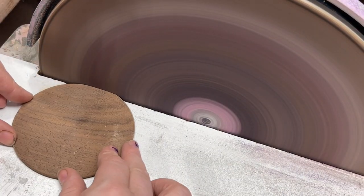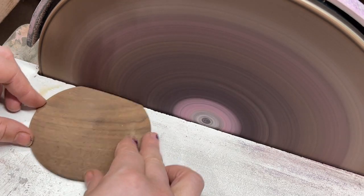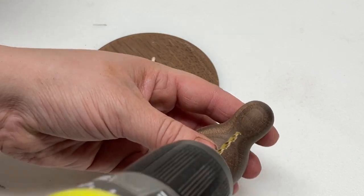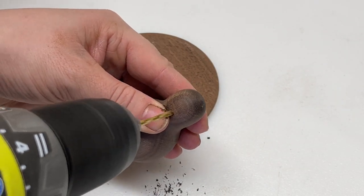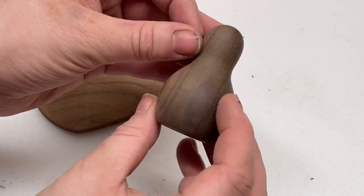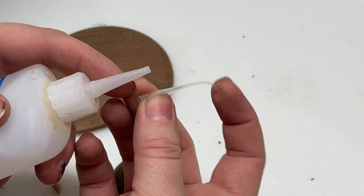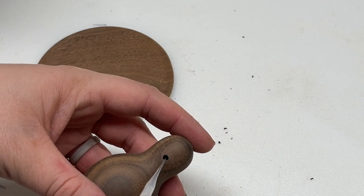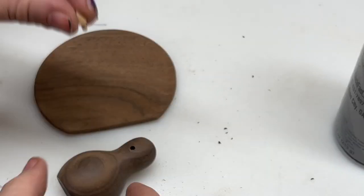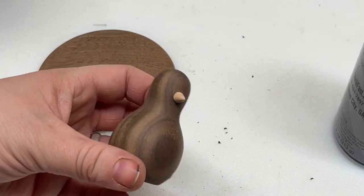I'm taking it to my disc sander, finding which side I like better for the front of the turkey, and then sanding a flat on the back. Because I don't want it to be a full circle — I want it to be kind of a semi-circle — I'm going to find whichever area I don't like and sand that edge off. Now I'm ready to drill the hole for the beak. I like to drill slightly larger than the tenon I've put on the beak, then sand the edges up a little bit so there are no sharp edges. With my CA glue, I put a little extender on there so I don't get glue all over the face. Fill the hole until you can just barely see the glue — you don't want it overflowing — spray with accelerator, stick it in there, and then it's good to go.